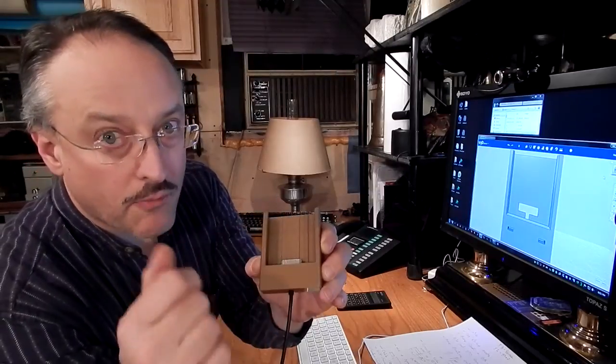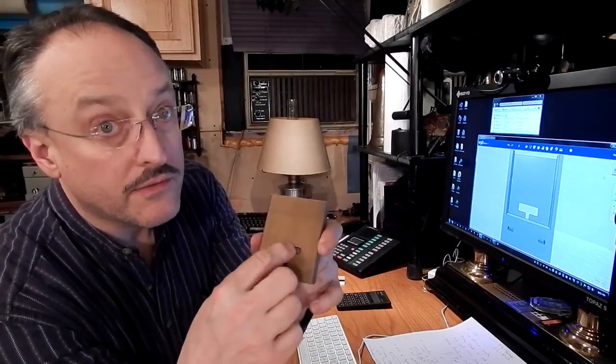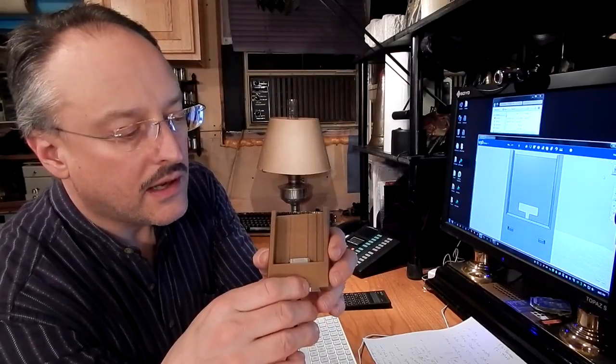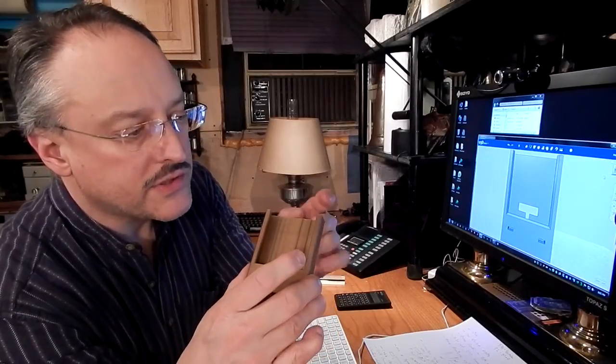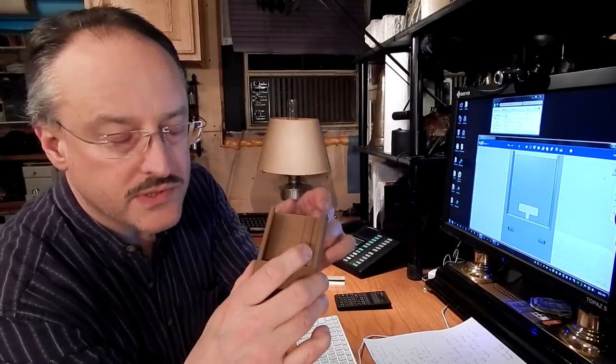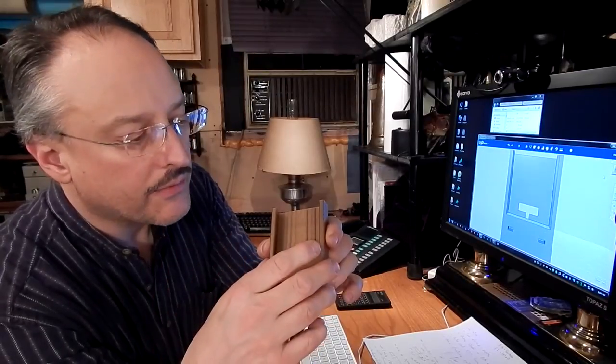I don't want to insulate the whole back of the iPhone, so I put some channels in the back that lead to the hole so that there can be some air movement through the case, and I'm hoping this will cool the iPhone a little bit. I think most of the chips that get really hot in the phone are up near the top. They're the transmitter chips and such. But I'm hoping these little channels will help some air come through without weakening the back structure. Also, they reduce the amount of plastic in the part by a little bit, and they're easy to make, so I'm going to go ahead and make those now.